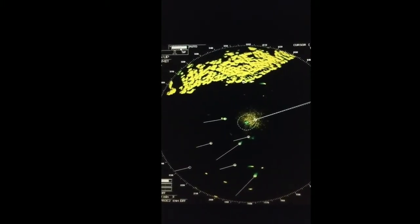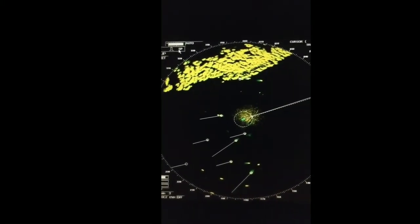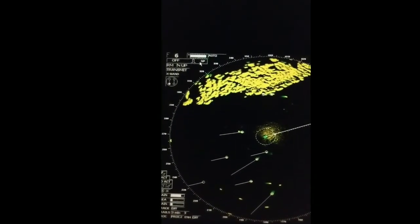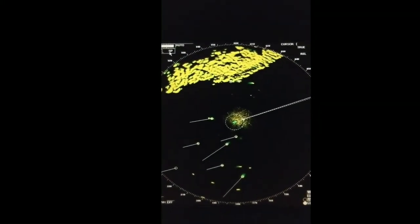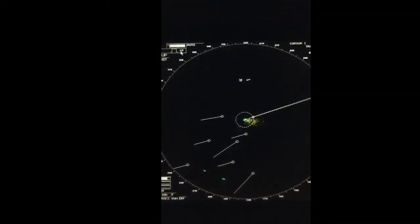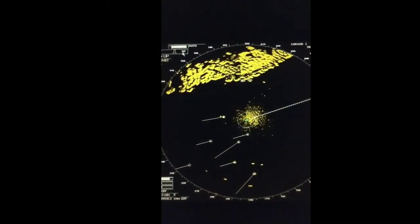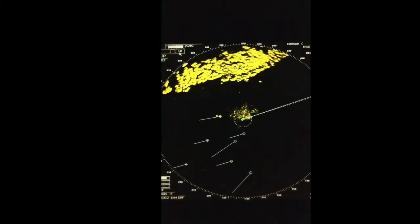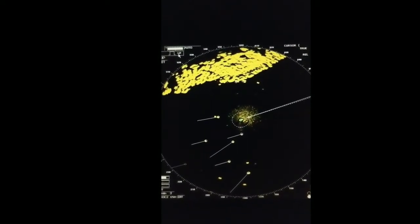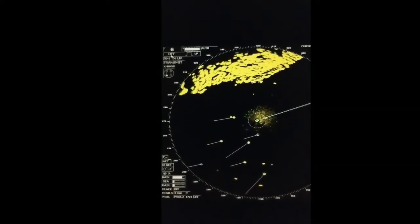This shows 'auto' — meaning the tuning is on auto mode. We normally keep tuning always on auto. Currently we are using short pulse. The radar scanner generates pulses — we can use short pulse (SP) or long pulse (LP). Some equipment also has medium pulse (MP). Long pulse is preferred for long-distance targets and short pulse is preferred for short-distance targets.